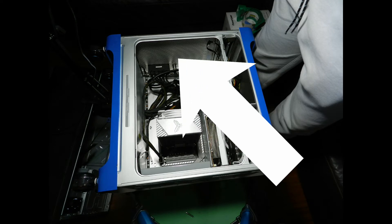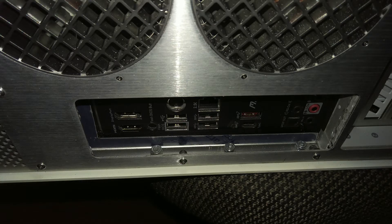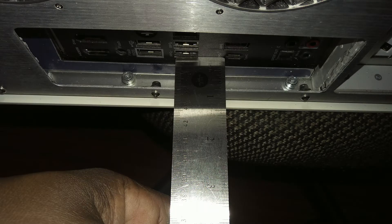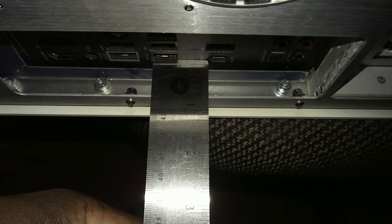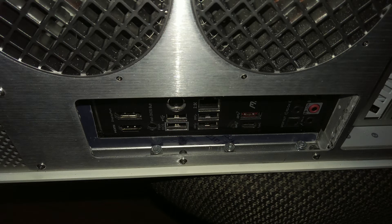The mesh design at the front of the case essentially makes the entire front part of the machine an air intake, but we'll talk about that later. The LaserHive kit worked out fabulously, but if I really wanted to play devil's advocate and find a fault, it would be this: it would have been nice to have some type of acrylic or 3D-printed spacer to sit between the case and the I/O panel. I understand why it wasn't included — it would have to be precision cut and since screw locations can vary, it would be best for each person to build their own. It's at the back of the machine so people won't see it, though it's still wide enough for certain insects and small lizards to squeeze through. A sponge or rubber outline would be appropriate, with cavities drilled where it sits above the screws.